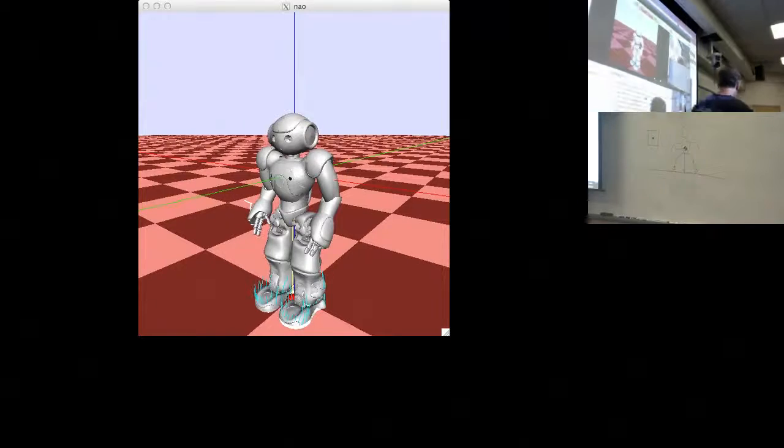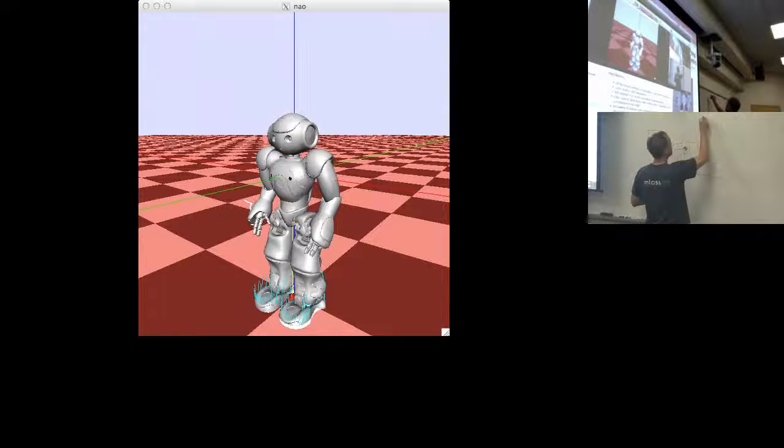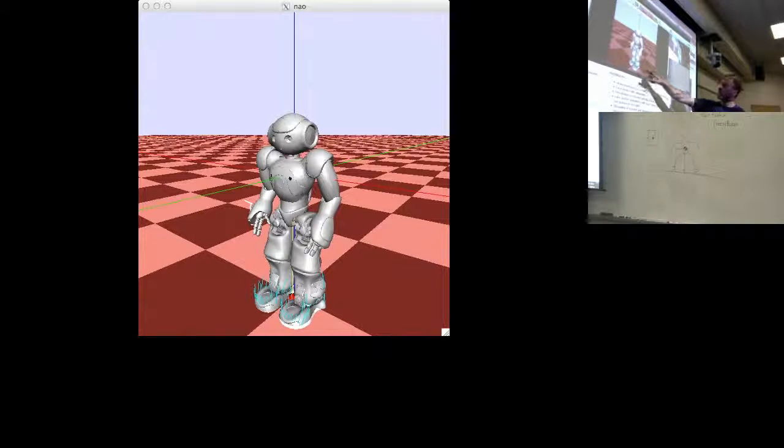So what did I just do? But I will send you instructions on that as well. On the NAO task window, right now I did something which is called freeze base. That basically makes the thing fall off and it's basically free and standing. And the moment you have that, you actually get the center of mass projected onto the standing plane. And that is your indicator where you are. You essentially need to get this red thing into one foot so you can stand on one foot.